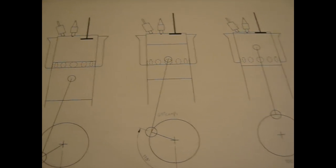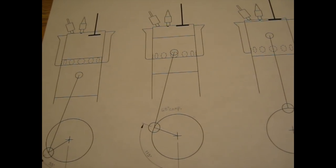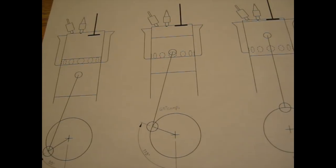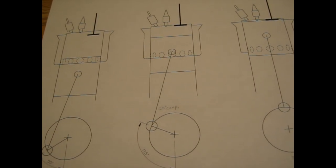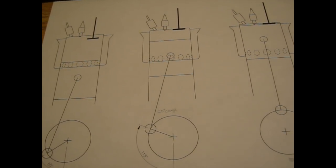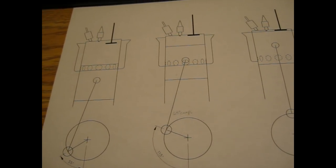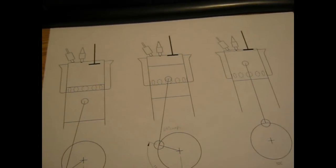Because it's a hyper expansion engine it doesn't work very well at low load conditions — there's not enough combustion pressure — so it actually loses efficiency if operated at something like idle conditions. It's mainly a three-quarter to full power engine; that's when it's the most efficient.